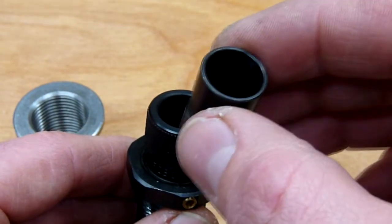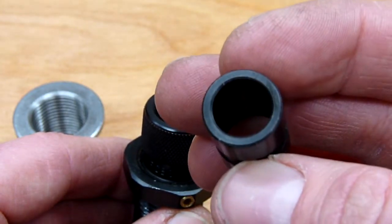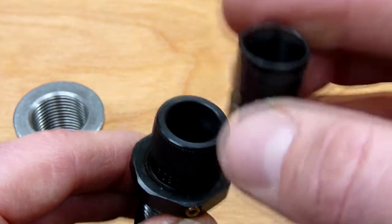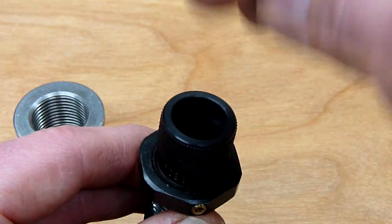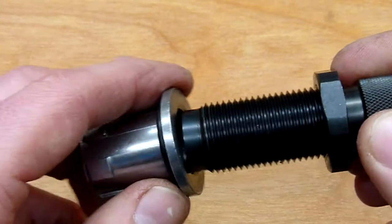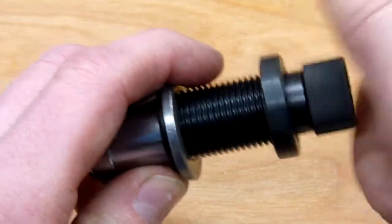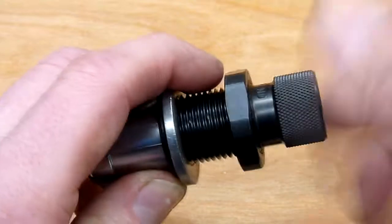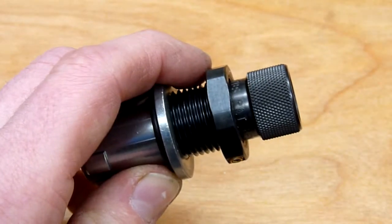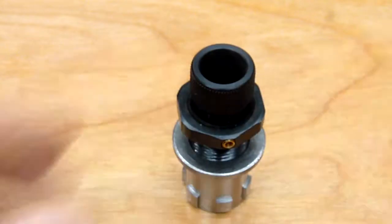If you notice, there's a slight angle on the cut on this side of the circlip — that allows you to get a precision screwdriver under there to remove the bullet finger assembly. Next we're going to take the bullet guide. The larger diameter opening goes up, kind of like a funnel for the bullet to drop through. Then we'll take our lock and load bushing and screw it in a little high, which allows us to lower the die body assembly in and adjust it properly.